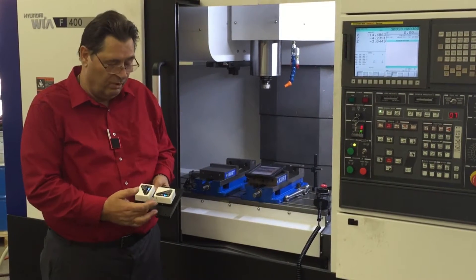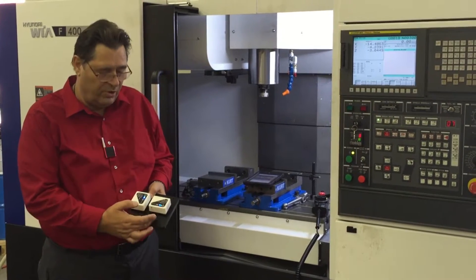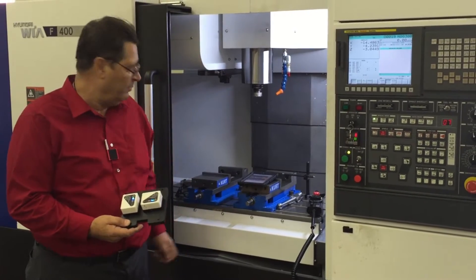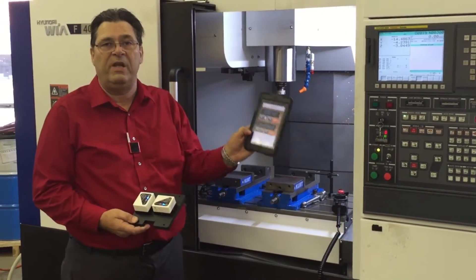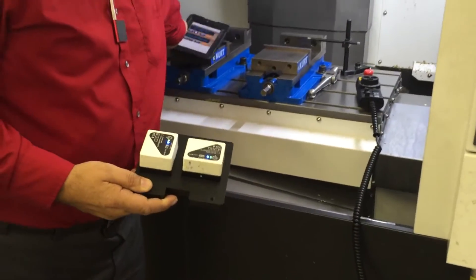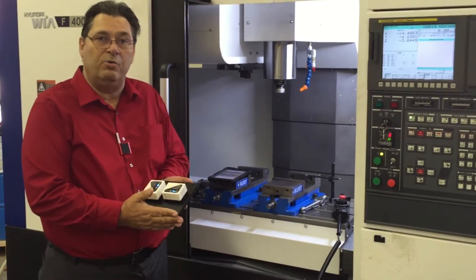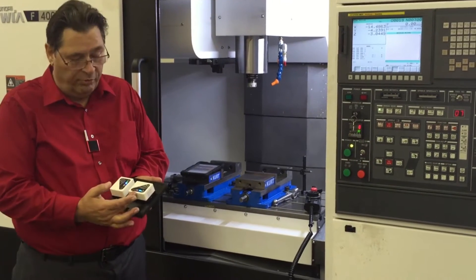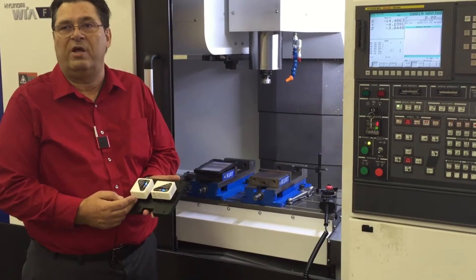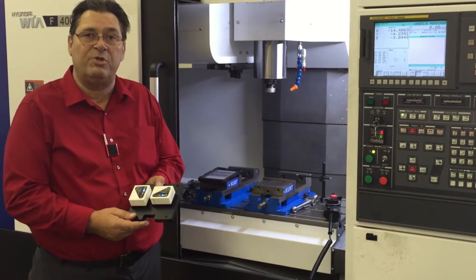What we have is a mounting here of dual AliSensor Levels. The AliSensor Levels mounted dual will enable us to level this machine in one setup using the mini iPad with a dual display. The first thing I'm going to do is place this inside the machine and use the iPad to establish earth level for both levels. One level is aligned for machine pitch, the other for machine roll.